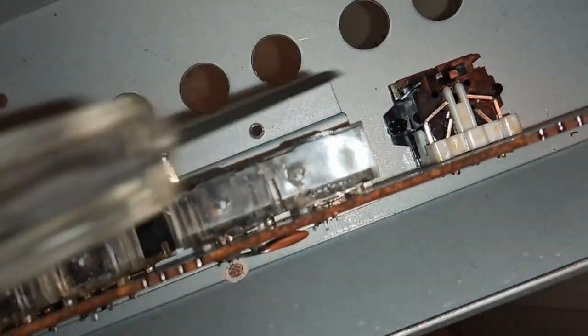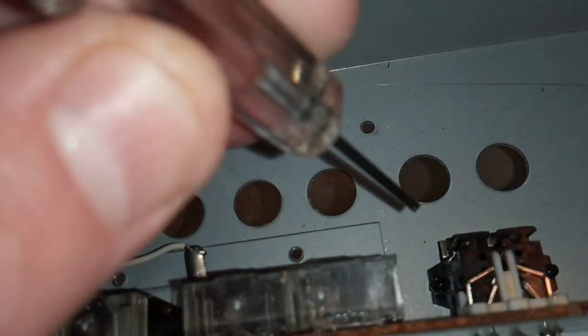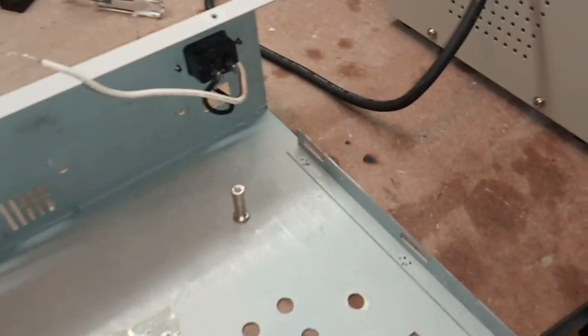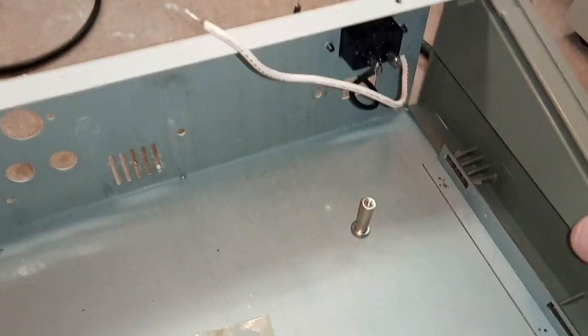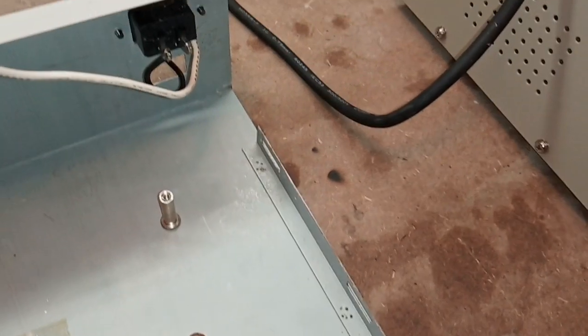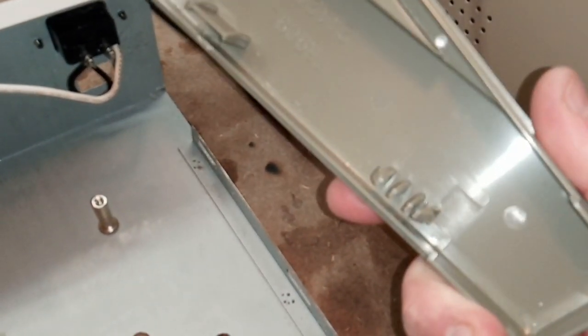One of the output circuit boards has these strange buttons attached with a button-inside-a-button mechanism. You have to push the inner button out first, then you can remove them — it's mainly a matter of finding an appropriately small screwdriver and pushing on that middle button until the whole thing pops out. I also removed the side panels to get the space needed to remove the on/off button, which is held on with plastic clips. You need to be careful not to break those little plastic clip pieces — I did that last time I opened it, so I'm fixing that this time.